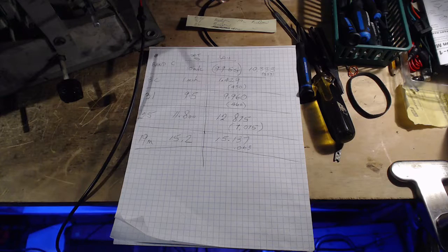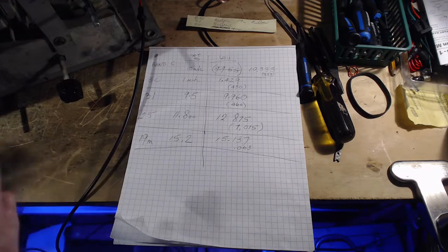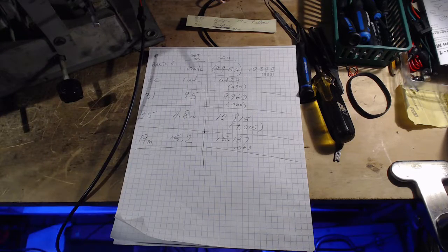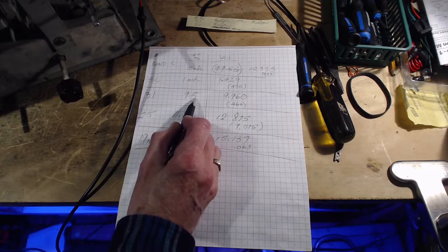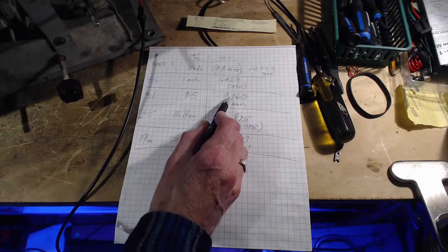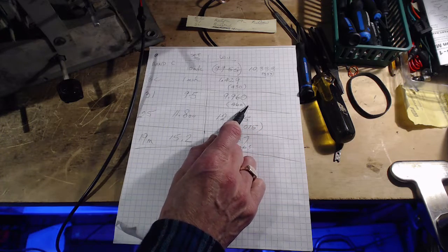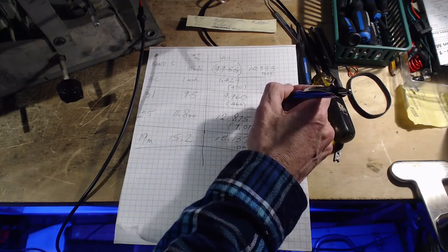Okay, so here's the unexplainable result I got from that. I looked on my SDR to spot what I'm quite certain is a local oscillator frequency. There are so many ghostly frequencies floating around in the SDR, it's easy to get it wrong, at least for me. So let's start with this one. 31 meter band. When you tune to 9.5, the oscillator runs at 9.960. That's a difference of 460. That's great. You're correct, or very, very close.